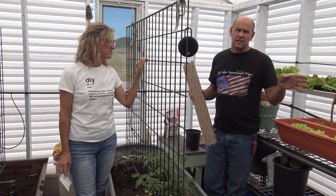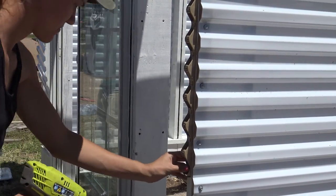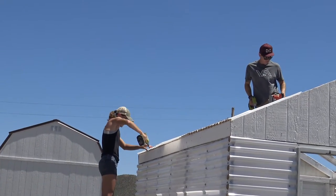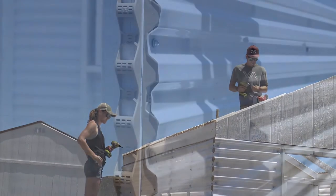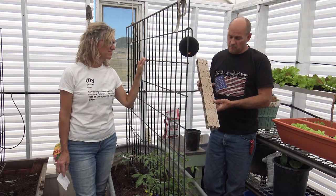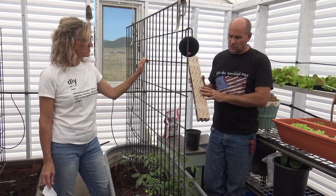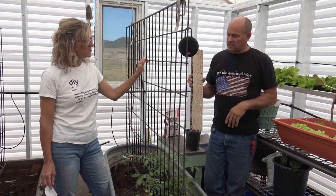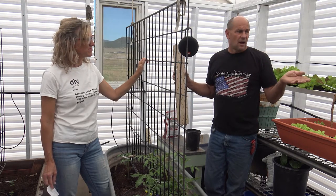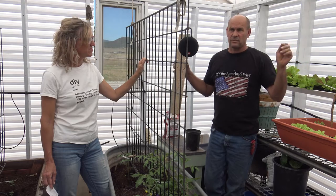On the ends where polycarbonate hits a corner or on the roof where it comes down to the eave, you need to use end caps. These have a wavy crown profile — the material we used was square crown. There was a mix-up at the store and we got two different types, but they work fine even if it's not ideal. Put end caps anywhere the panel edge is exposed to wind; they stop wind infiltration and keep everything nice and tight. We're having strong winds today and you can see it's super calm in here — it keeps the place airtight.